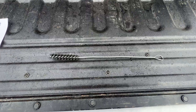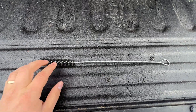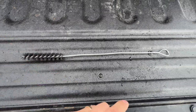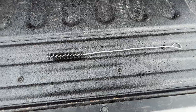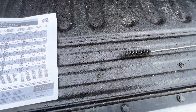This is the nylon brush here — essentially like a pipe cleaner with rigid nylon bristles and a little handle on one side. You put that in there and pull it out and that actually scrubs the concrete powder out of the hole we just drilled. So that's really important to do as we're talking about.